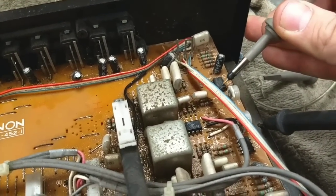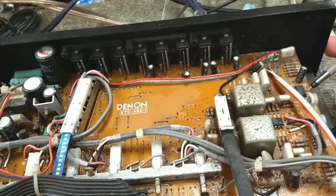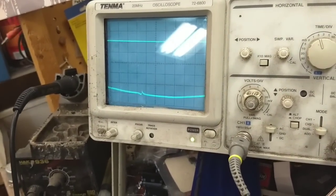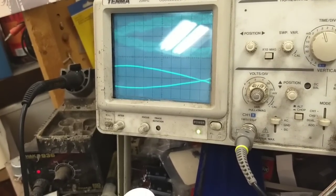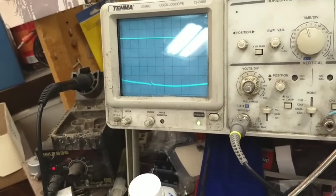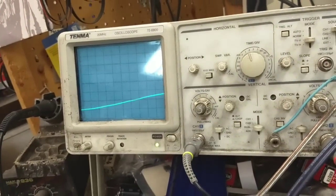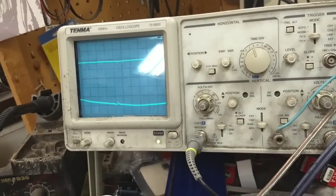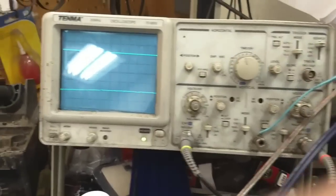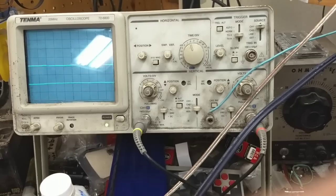I'm going to guess here these... let's see. That's the signal I'm reading on one of the phono preamps. That's weird. Every single pin is that garbage there. Yeah, it can't be right. And that's just more junk there. And then it goes through these filter networks here. Maybe it's just trying to sync on that. Let's get that out. Nope, still junk. But I've got symmetrical voltages here.